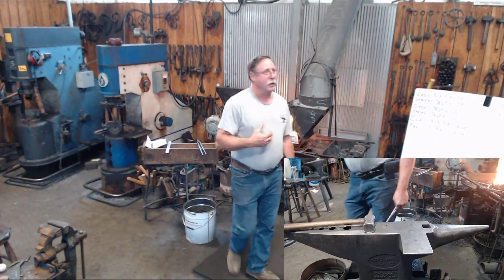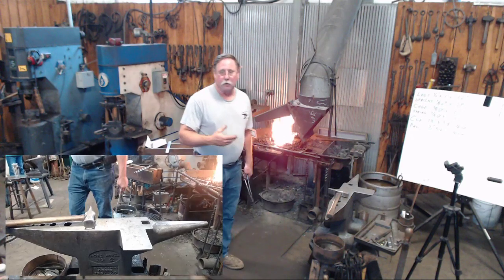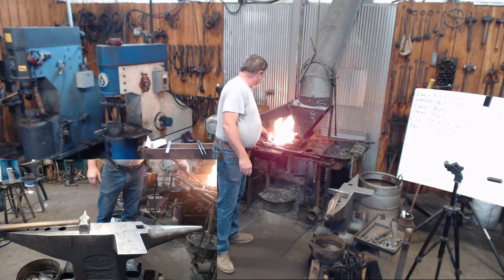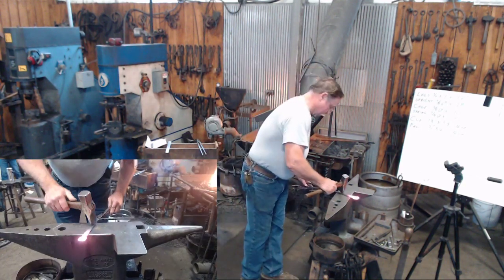I'm going to take the second heat, I'm going to come over the off edge of the anvil, and I'm just going to round that foot up a little bit. Well, you started out by doing a half face blow, yes. And then you switched to your peen. To spread it out more, Todd. Yes, okay. Exactly.